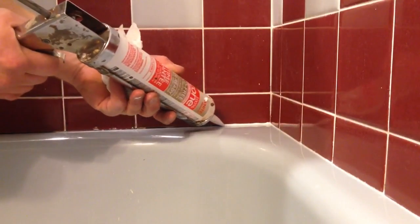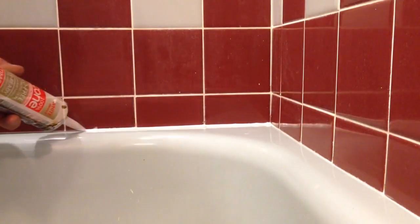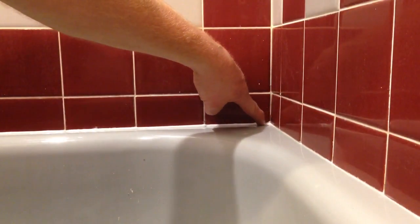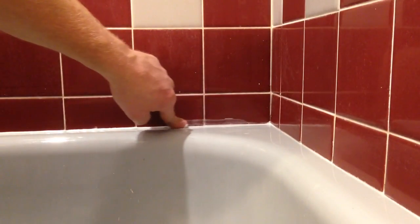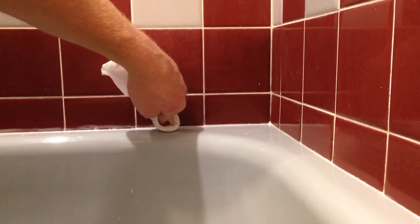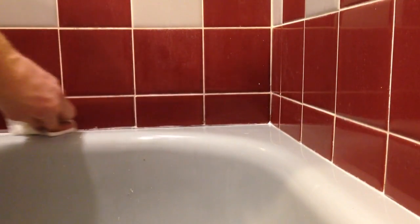So then I can continue on down the sidewall of the tub, just draw a bead all the way down. Then I can take my finger and push the excess caulk down into the crack that I'm trying to seal off and give it a nice smooth corner, and again I'm wiping it off on that paper towel — any excess that comes off my finger. And you can see it's up the wall, so I'm going to get my paper towel and wipe down the wall and the tub, leaving just the caulking in the crack, and that gives a nice, clean, even look that'll last you a good long time.